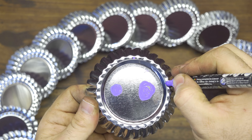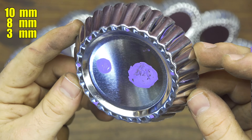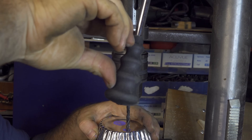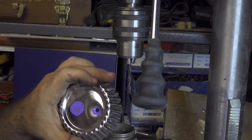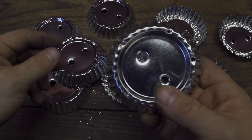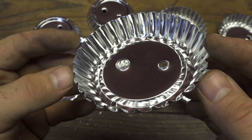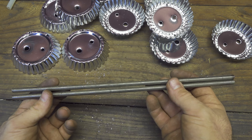With a marker I can mark some holes — two in the middle and some smaller ones all around. The smaller ones are just like an air exhaust for air bubbles that will form under the cup, and the two ones in the middle are for placing two electrodes. After drilling all 20 of the plates, we've got a 10 millimeter hole, one that is 8 millimeter, and all around 3 millimeter holes — just for air exhaust.